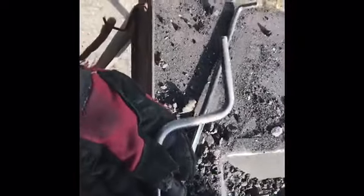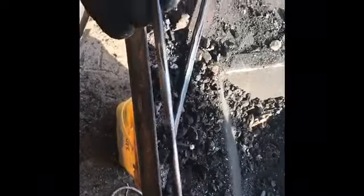And here's a little handle I made for my clinker breaker. So this will get welded up under here to the clinker breaker that's under there, and then I'll make a little support for it right here on the front edge, and I'll be able to turn that back and forth from here for my clinker breaker. So those were the 2 small improvements to the forge that we're knocking out today, in addition to that last pair of my quick tong bundle.